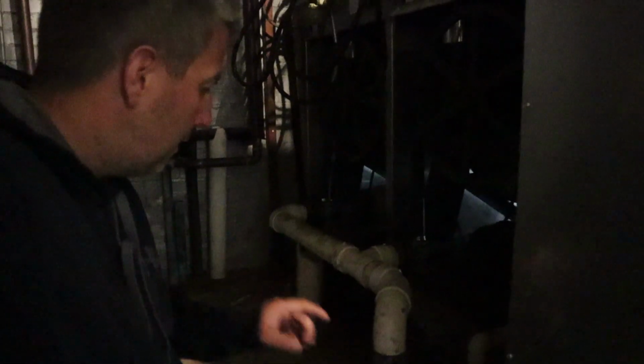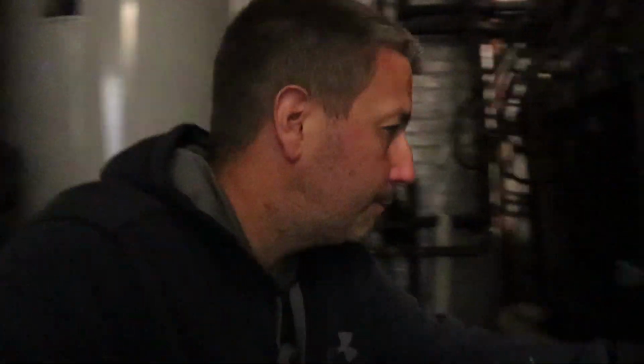Somewhere down in here we got a lint or a clog, because when I went to remove this after I tested those machines, this was just backing up with soap. It couldn't drain. So the air fill was, it couldn't get rid of material to add more material, and it was taking too long to drain itself. It basically could not rinse. It couldn't go to the next cycle, so it said air fill.